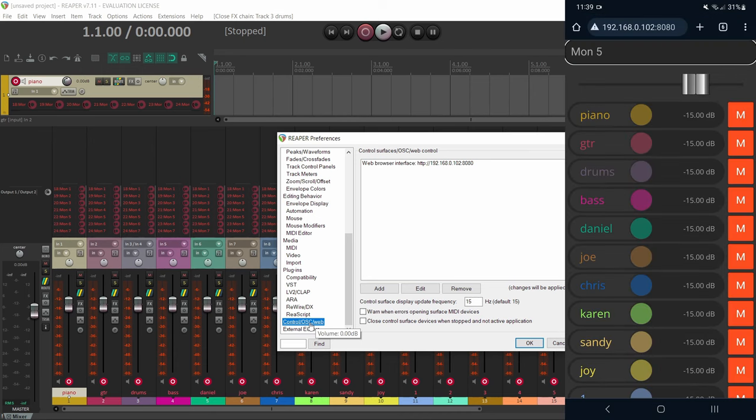Before buying the output box, you can try this out to see if it works for you. Go to the mixer routing menu, go to the aux out — these are the physical XLR outputs on your mixer — and assign them to USB 1, 2, 3, 4, 5. Try it with Reaper and see if you can play live with it. If your computer handles it, great; if not, it's not workable. Usually if you want more mix buses, you'd have to get a bigger mixer — but if you only have a few channels but lots of destinations to send audio to, this is a great solution.